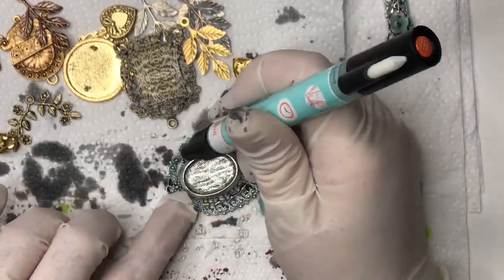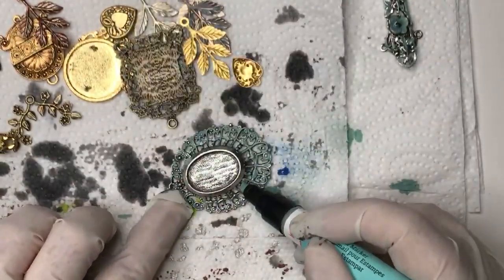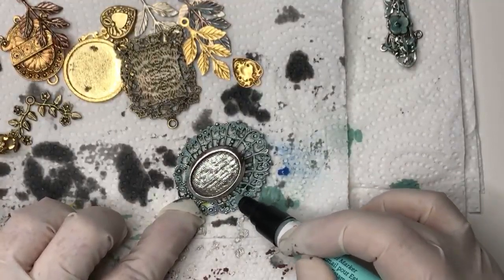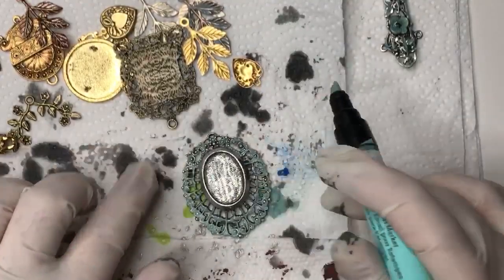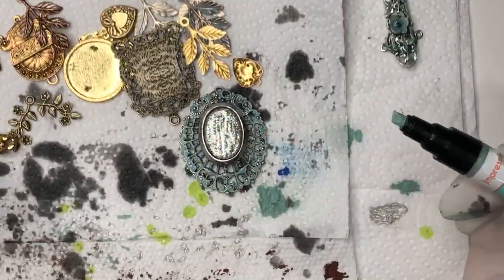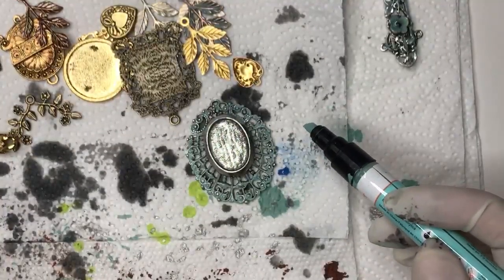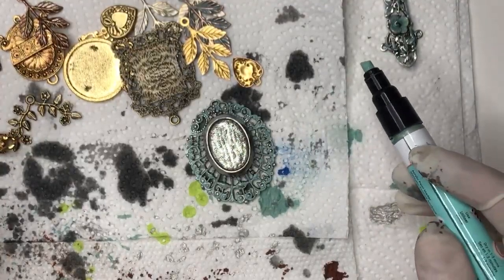I'll tell you what I'm going to do after I get this paint on here, a little thicker. I'm going to take a piece of gold and put it on it so you can see what I'm talking about. The reason I'm putting this on thicker is that I'm going to let this sit and come back tomorrow, and I will distress some of it off. If I think I need more, I can apply more then, or even another color. I could distress a little bit of this off and go back over it with a little bit of the flowing charcoal black from the tester's pen and make the detail really pop. So there's a lot of ways you can go with it.